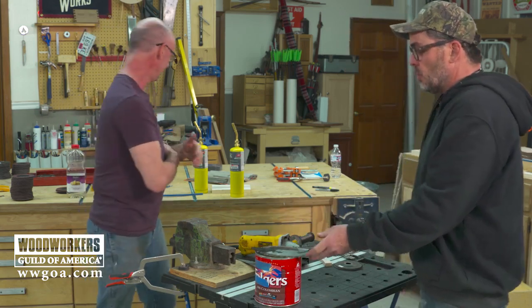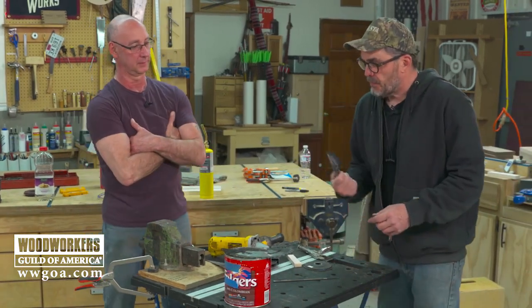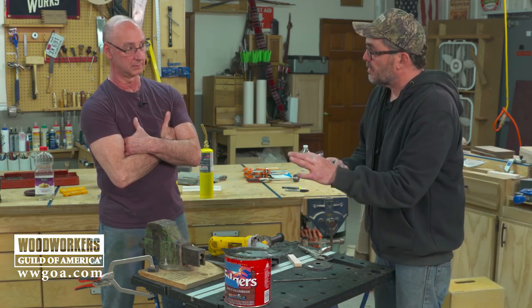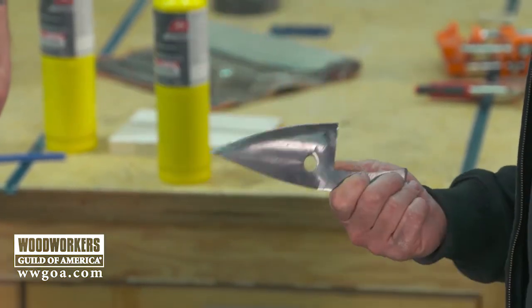So what we could do with the knives is try and maintain that red hot on the edge. So we can go like this, just on this edge. And this is much thinner than that, so this will stay redder faster. It'll get redder faster, but it'll also go colder faster. And so we can try and do that and then...